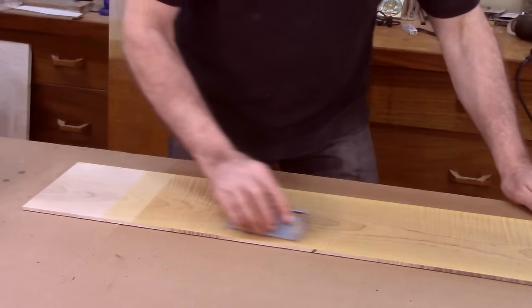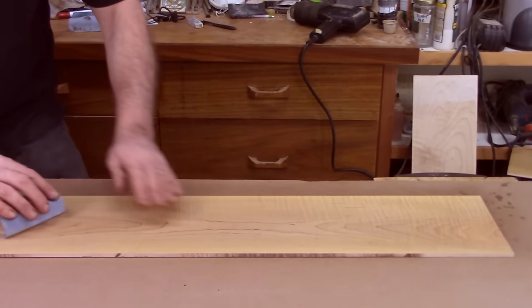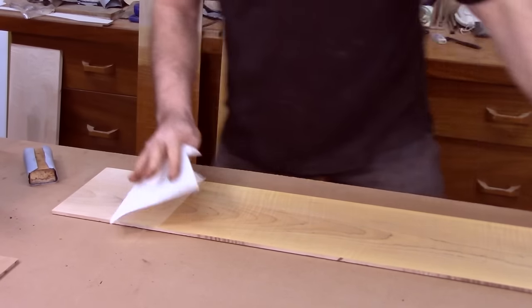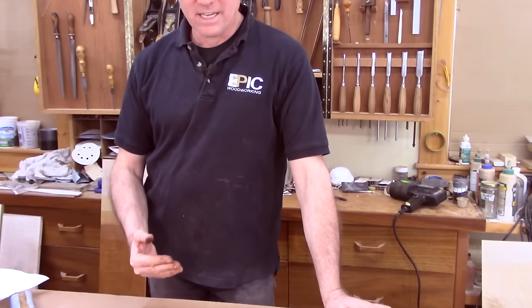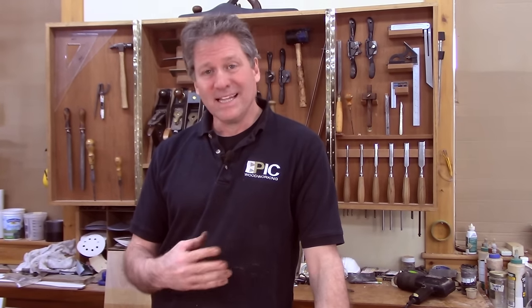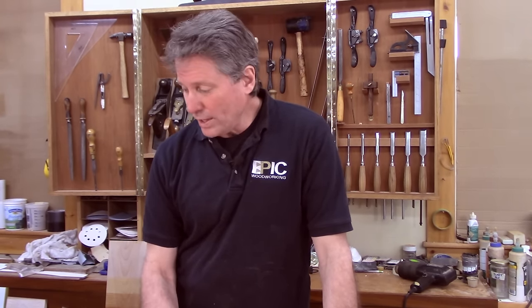Here's our sample already brought up to that point. I'm going to very lightly sand off any little bumps or nibs in the shellac and dust that off. Now here's the step that gives you the antiquing effect — to do that, we're going to use a pigmented stain called a glazing stain. Notice I'm not putting that pigmented stain directly on the wood — I've sealed it with the shellac, which prevents most of it from actually penetrating into the wood, and we'll be able to wipe off as much as we want.